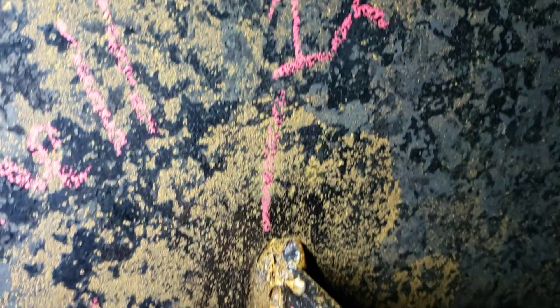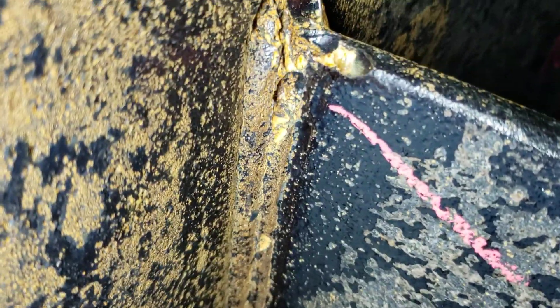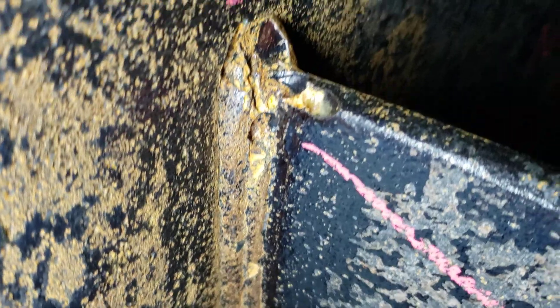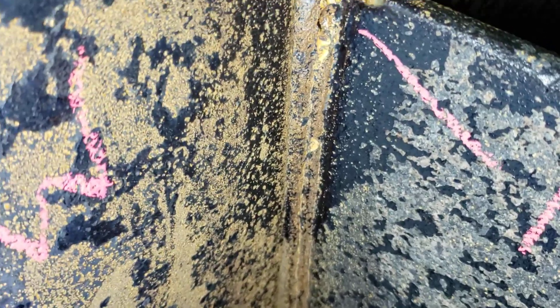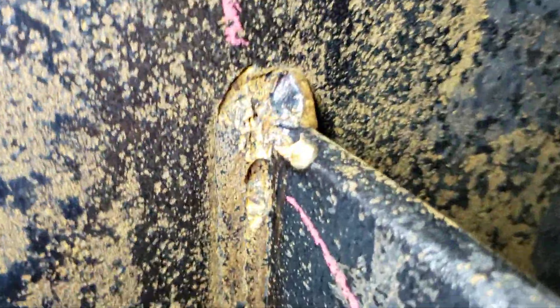The thickness is 125 thousandths — an eighth of an inch — and that's in the shell. Right here in the weld on the anti-rotation bars, it's actually 140 thousandths, which is quite significant. The 125 thousandths reading is in the shell itself.